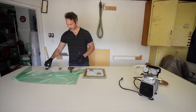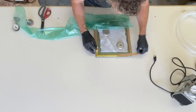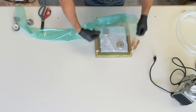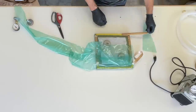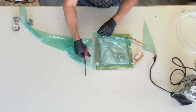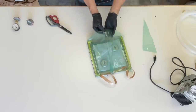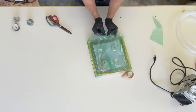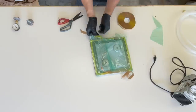And we'll try to put a few pleats in this just so I can kind of like learn how that goes. Pleats are often necessary to get even pressure along your whole part. You don't really want the material to bridge along an inside corner. I'm just practicing that technique here, even though this material is called stretch-a-lon, and it actually is supposed to take about 300% of its size in stretching. So probably overkill here, but just trying to get familiar.